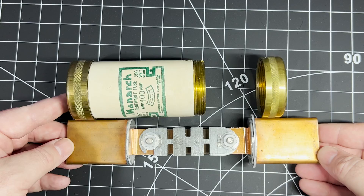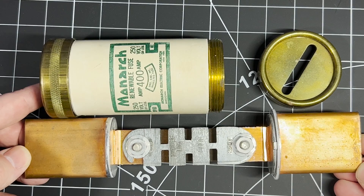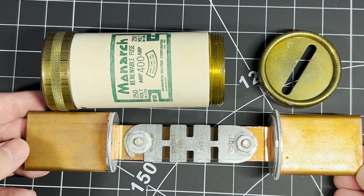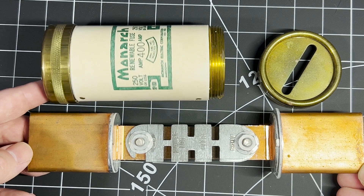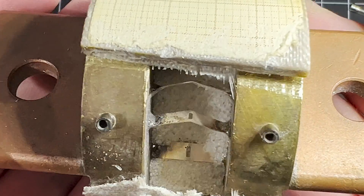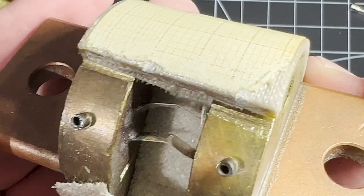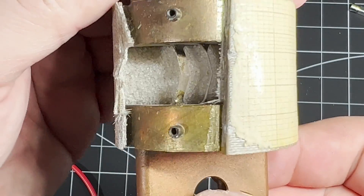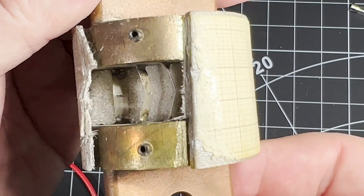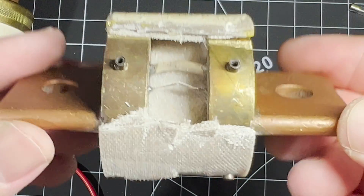As you can see, even though on a larger scale, all of the basic components that we saw in the smaller cartridge fuses are applicable here too. We have copper terminals and brass end caps and an element which is capable of handling the current and voltage rating printed on this particular fuse. As I mentioned earlier, when you're dealing with higher voltages and a fuse blows, it can sometimes start to arc and jump the gap where the fuse element has blown. This is where silica sand-filled fuses come into play, as they can quench the arc by filling the gap where the fuse element was. Should the arc still sustain itself, it will melt the silica and form a complete blockage within the interior of the fuse, which ultimately ensures power to the circuit is interrupted.